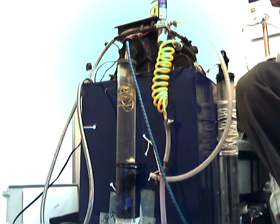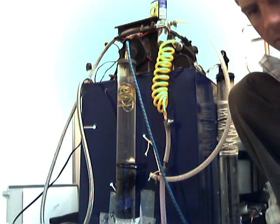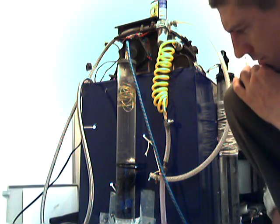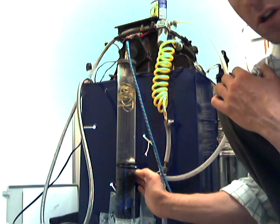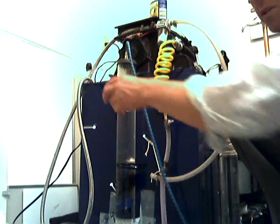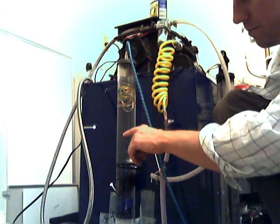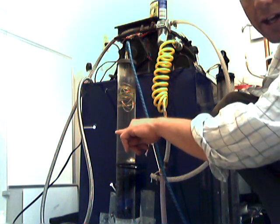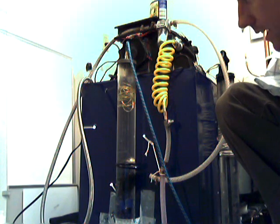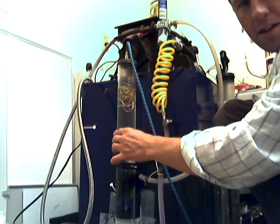Here's what I've got going on - this is the back of my hydrogen torch. I just got my new gas scrubber bubbler put together and had to do some modifications. It turns out the air stones caused so many small bubbles that they would slowly rise through the tube, and because it took so long for those small bubbles to rise, I would have to put the water level way down - and that's just not going to do it. I can't have a big void like this blast chamber of gas.